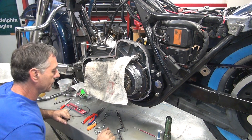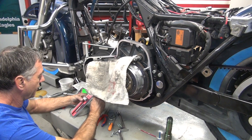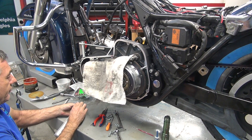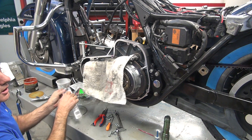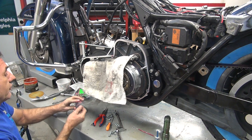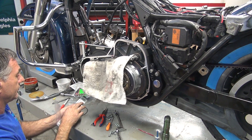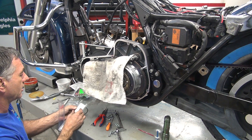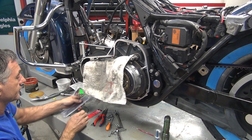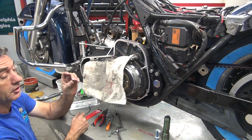You hold it, you work the camera. You've got a little sample-length helicoil. Why don't you buy long helicoils? If I knew I could buy bigger ones — I didn't know they came in different sizes. I'll use two and a half. They come in two, two and a half, and three diameters. You know what that means? These are probably one diameter, or just about it. These are really short — probably one diameter. It's a quarter-inch bolt.